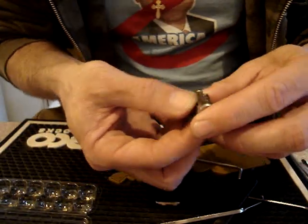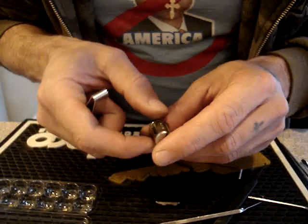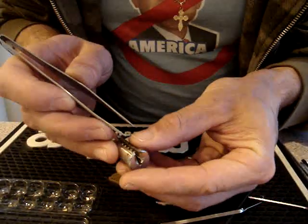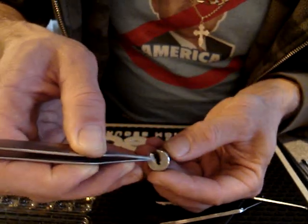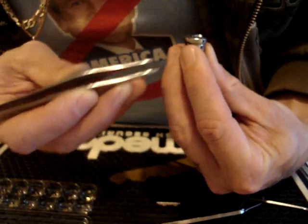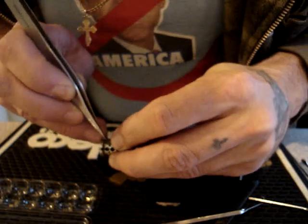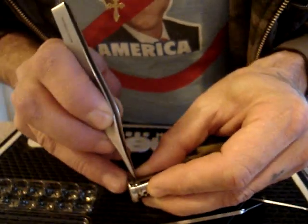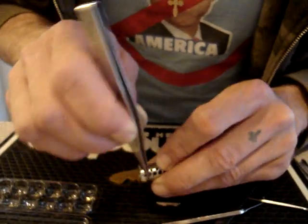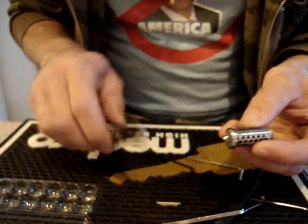Now I'm going to take note of the positions of these sliders so that when I go to pick it again it'll be a little bit easier. I'll show you a few more of the cool security features of this lock. You have anti-drill pins here, here, and also here, running through the face of the lock and continuing on the other side of the keyway. There are also three anti-drill pins right here — one, two, three — and there's also one here on this side. So they have anti-drill pins running through the face of the lock as well as all directions behind the lock, all in through the plug. I believe that's a solid stainless plug running in a brass shell.